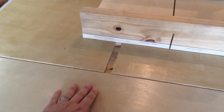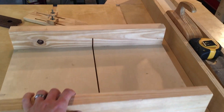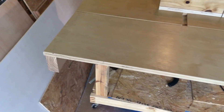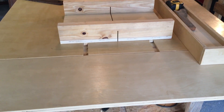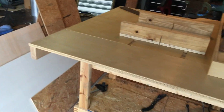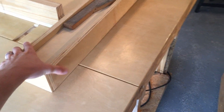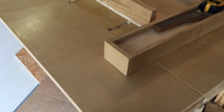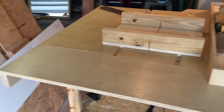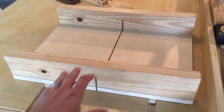My tracks don't continue through here. I figure that if I'm going to be using the crosscut sled, I'm more than likely not going to need the outfeed table, so I didn't plan on continuing them through. I might continue them through if the need arises, but as you can see the fence continues all the way through to the outfeed, which is nice, and I can really work with the big stuff more.